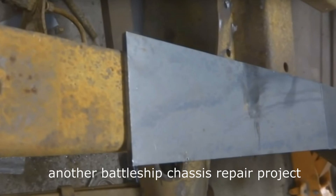If you're using reinforcing plates, don't use plates which are thicker than the original wall thickness provided by the manufacturer. For my current project I bought 2 mm plates and they're perfectly adequate. I see examples on the internet where people use 5 mm or 6 mm plates — I want to scream. There's no point in it; in fact there's very good reason not to do it, because big thick heavy plates will have big thick heavy welds, which is not only expensive but also creates problems like welding distortion.